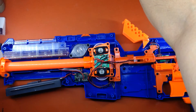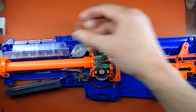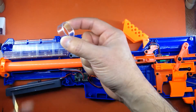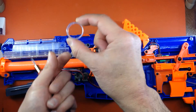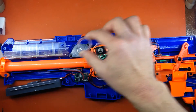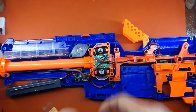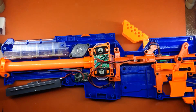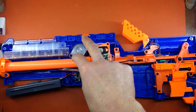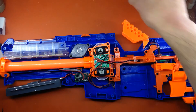Alternately, with a little bit of shell modification, what you can do is create a resonance chamber — this is an old lightsaber building trick. You can have something like this going on to the front of the speaker, and that will create enough resonance to increase the sound slightly, but that's not going to fit within the stock mount, so more modifications are required. The peak volume you're going to get from this circuit is about as loud as an aftermarket lightsaber.